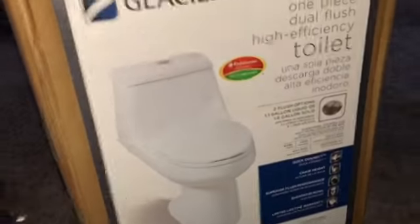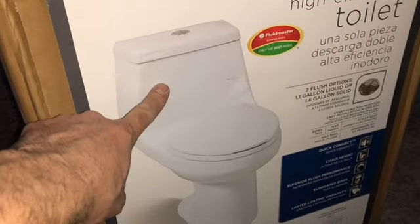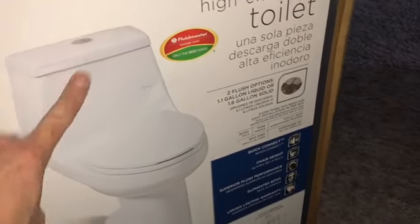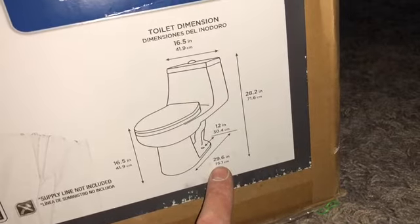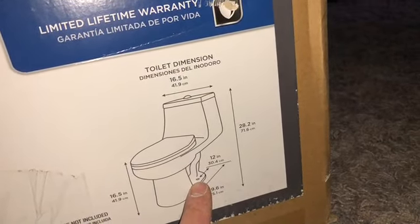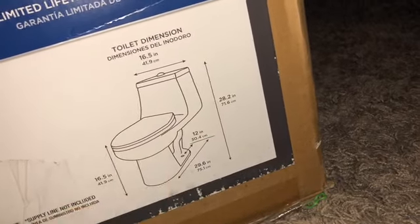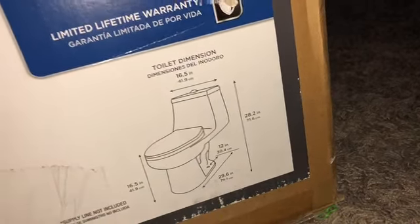This is the new toilet. I've got a little boy who's five years old and can't aim correctly, but with this type of toilet he can pee here and it drips down into the bowl — makes it a lot easier to clean. It's a one-piece toilet. Also, before you buy a toilet, look on the side and take measurements. Most standard toilets are 12 inches from the center of the drain flange to the wall, so measure that before buying.